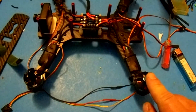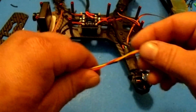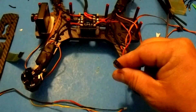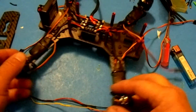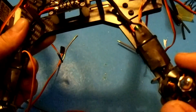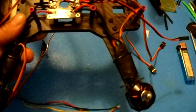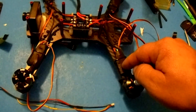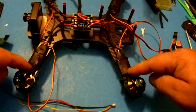I explained clockwise and counterclockwise motors and how to tell them apart. The camera wire is all soldered up and heat shrinked with matching colors. For the FPV transmitter, the power wire is already soldered to the power distribution board. Also worth noting: I soldered the motor wires directly to the ESCs — no bullet connectors. I have a video explaining how I did that, including removing the heat shrink tubing and figuring out which wire was one, two, three on the ESC and motor. So there's no extra wire anywhere.